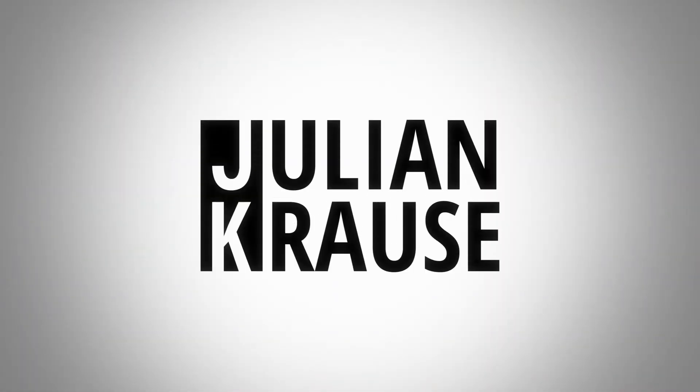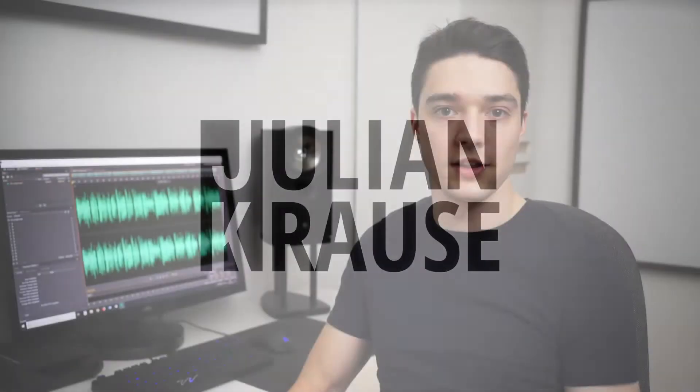Hey, Julian Krause here. When I was recording a line level signal with my Zoom H5, the recording was distorted even though the clipping indicator never lit up. So what went wrong? After that incident I made a few tests and recorded some signals with all kinds of amplitudes to see if I could reproduce this problem. And yes, it was actually very easy to reproduce. I found out that if you turn down the gain, at some point the H5 cannot handle the signal anymore and simply clips. The problem is that this is not evident on the level meter or the clipping indicator.